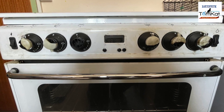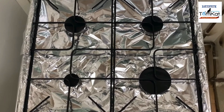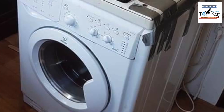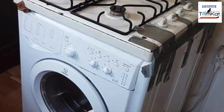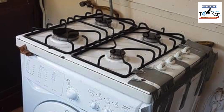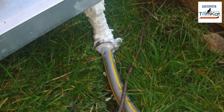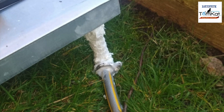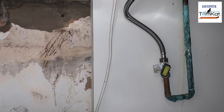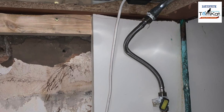Is the cooker or hob being protected with silver foil? Hopefully not. A bit of garden hose, silicone, and a jubilee clip does not meet the criteria of BS 669 for a cooker hose. It's good to see the correct gas isolation valve was used, but who has connected a hob up with a flexible tap connector?